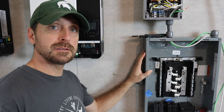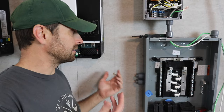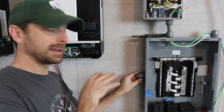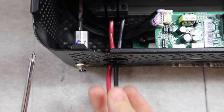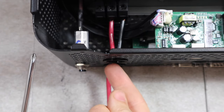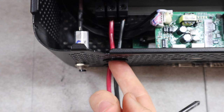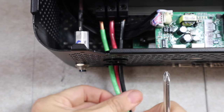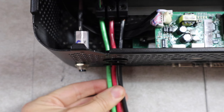I've already put the fittings on the sub panel — that's just easier to do since I don't want to take everything off the wall. I want to get everything up and running before I stick conduit on everything. The Growatts are nice — they come with these protectors for each hole, and you can put a conduit connection there, which is what I'll do in the future. The wires are protected from getting cut. We've got our AC input in the front and AC output in the back — just come up into the terminal, insert it in, and then screw it into place, making sure it's nice and snug.